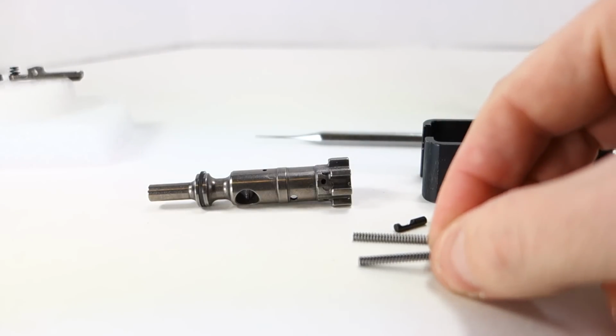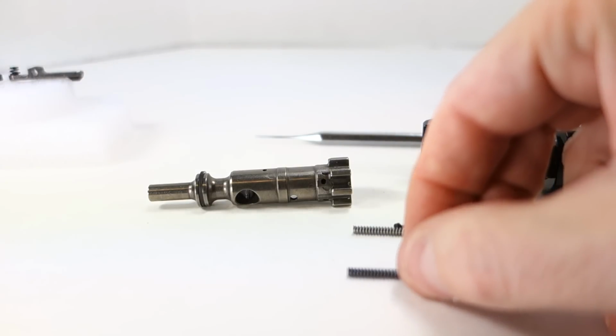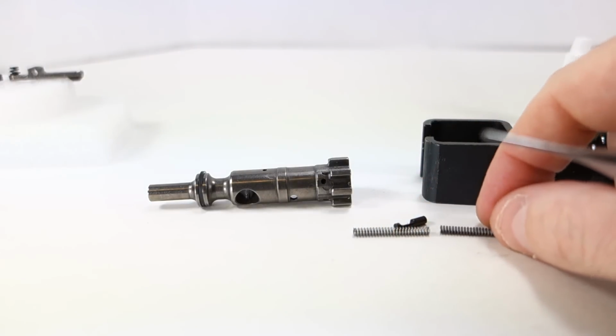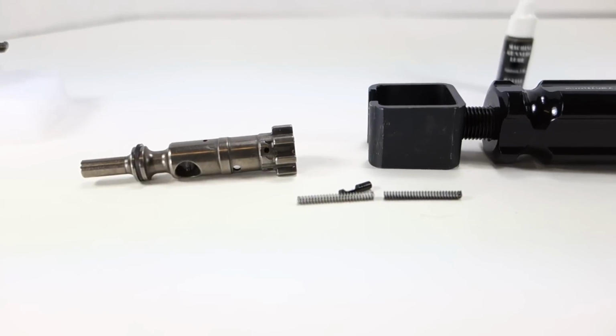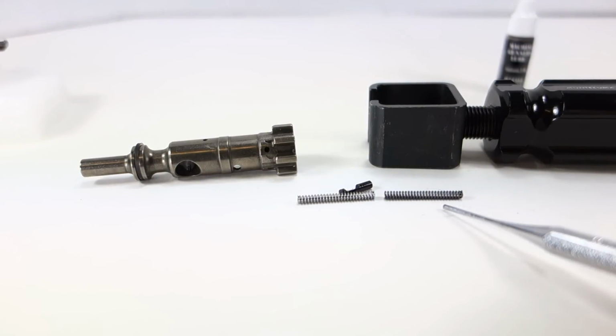And here is the ejector spring provided by, of course it wants to keep rolling, Sprinco. The size, the length, the diameter appears to be the same. There is a color variance, and I believe that is because this is a stainless steel ejector spring, and this is the chrome silicon moly plated cryogenic processed ejector spring.